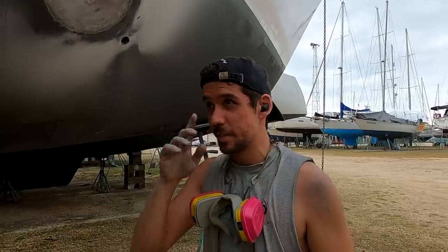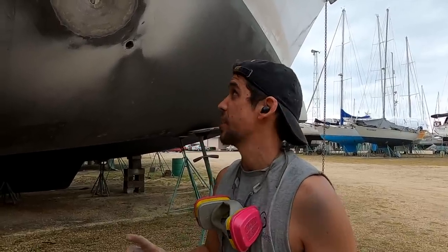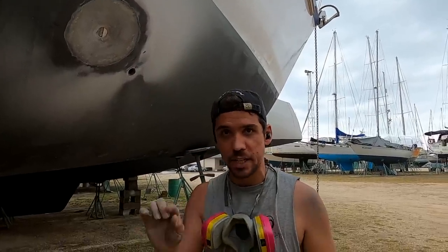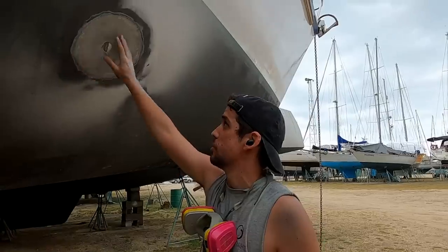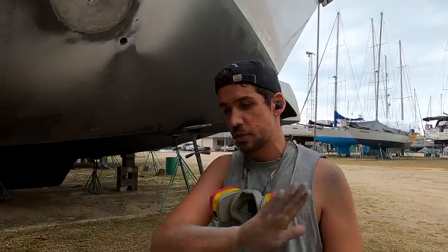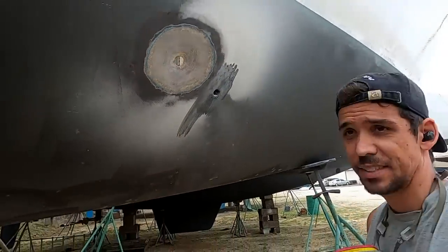There we go. It's as much as you can manage, but I've done, it's an inch and a half hole. So I've done a 10 inch or a 12 inch, I think, overlap. The width of this is 12 inches, so that when I fill it with progressively smaller patches of fiberglass, there'll be lots and lots of overlap, and so it'll be really well blended with the existing hull, so that when all the little pieces go in and it's all filled and faired, it should be like there was never a hole there. How much dust?